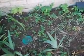Moving further along, in this exterior inspection, we're looking at walls and foundation in general, because what we're looking for is signs of movement in the building. Now, foundations themselves can have cracks in them. They can be there from the day the building was built, but they don't necessarily mean that the building is being stressed by movement.